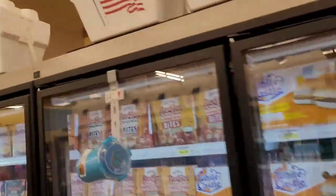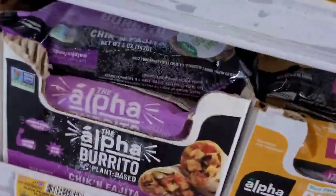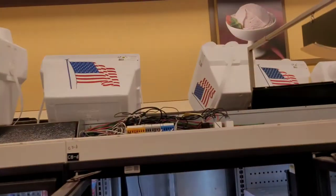All right, so here's what I'm getting from all this. The fans are running. This is C7D. C7C and C7D are all in defrost, so the fans should be off. So why are the fans running over here? I think we've probably got a relay that's stuck up on the top of it.